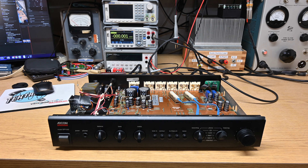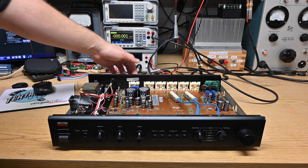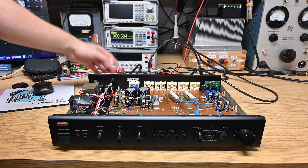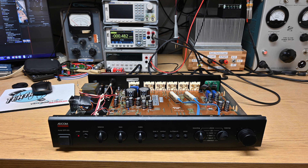I have the audio oscillator from my distortion analyzer plugged into the video/aux port, set to video aux, with the volume all the way down and 100 millivolts of signal into that input. There are two outputs on the back: the lab output which is direct coupled and the normal output which is capacitor coupled. I flipped it on — no issues on the dim bulb tester. On the lab output left channel I'm getting 0.5 millivolts DC, and the right channel is 0.2 millivolts. No problems there at all.